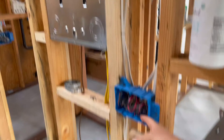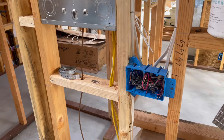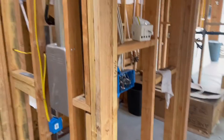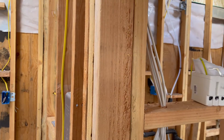We also put in a ceiling fan, so we've got four can lights in the living room plus the ceiling fan. That switches off this switch over here — we've got a three-way: one for the ceiling fan, one to turn off the living room lights, and the other turns on the kitchen lights. In the hallway we have another switch to turn on the hallway light and another for the kitchen lights — same can lights in here, four of them with one right over the sink.